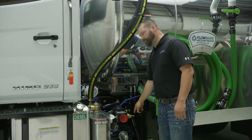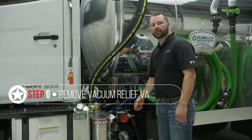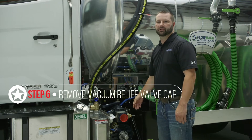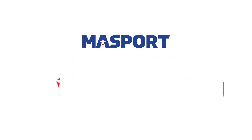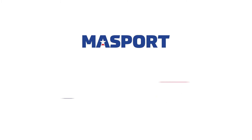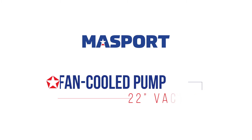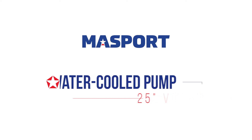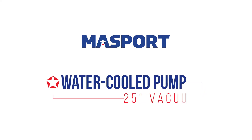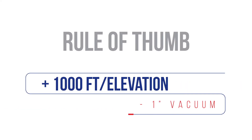Come over and inspect your vacuum relief valve. Some vacuum relief valves will have caps on them — you'll need to remove the cap in order to adjust it. For an air cooled pump like the one here, it should be run at 20 inches of vacuum. A fan cooled pump can be run at 22 inches of vacuum. A water cooled pump can be run at 25 inches of continuous vacuum. As a rule of thumb, for every thousand feet in elevation you're working at, your vacuum levels will decrease by one inch.